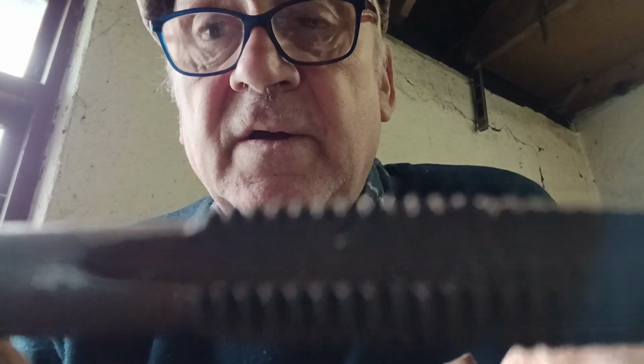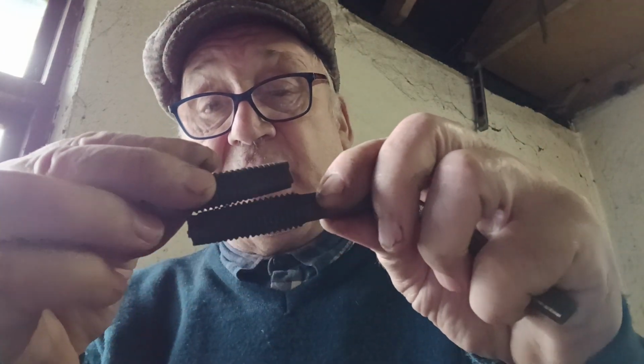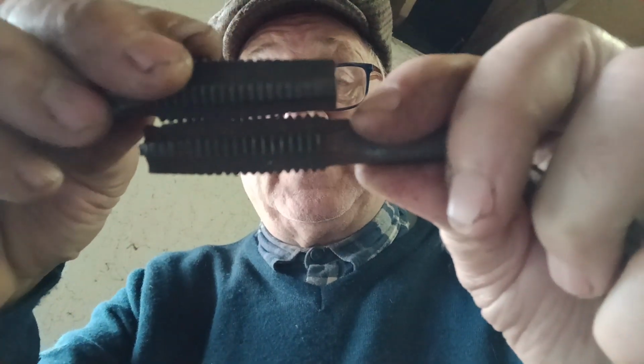I might be able to post a video on it, but anyway, we're here to deal with threads now. The first thread we deal with is the British ones, and here we deal with Whitworth, Joseph Whitworth. Joseph Whitworth put out this first thread, and it was a 55-degree thread. I see Whit written on these. I see 5/8 Whit. It's designated by the diameter of the top of the thread, and then the head's width. And there's another 5/8 Whit, and as far as I can see, they fit exactly.